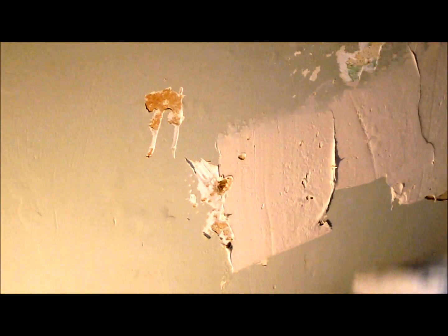I've got the loose off. We'll just put this corner cement up. We could put a bit of waterproof in with this and paint it on the wall first, but I couldn't find it actually. Whatever you do won't work anyway really, unless you put the silicone in the bricks. So we'll just put that on, let it set a bit, and come back and finish it off in a minute.